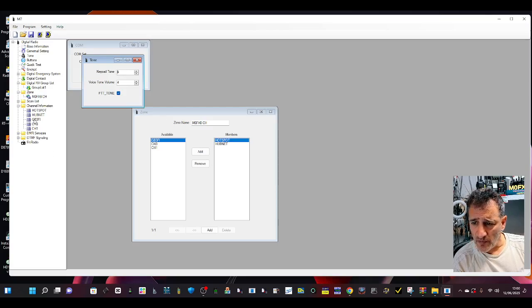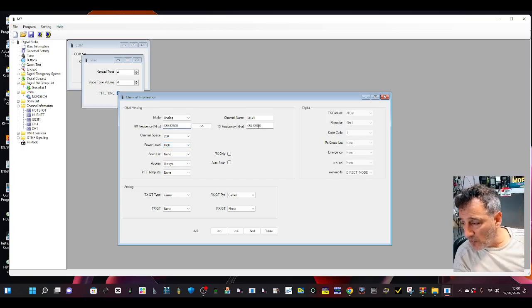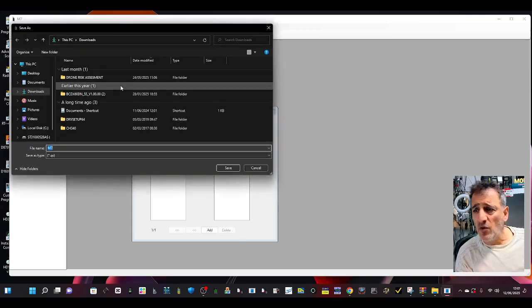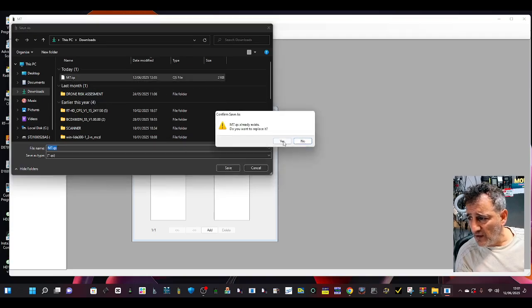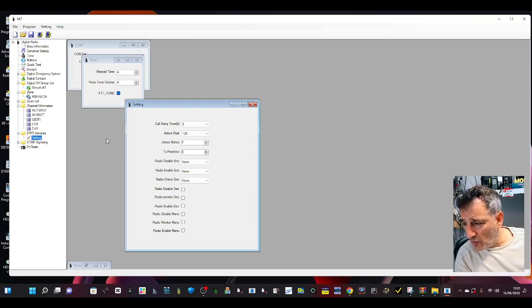For an analog channel like GB3FI you don't need to worry about slots and all that because it's analog mode. There's analog — then you put in the receive and transmit frequency. I've noticed a slight change there to what I put in. And I've noticed that when you save, go File — I've been going Save As, otherwise you get an error. Save As. DMR service — haven't used that yet. Call hang time, all that kind of stuff — which many of us don't really use.